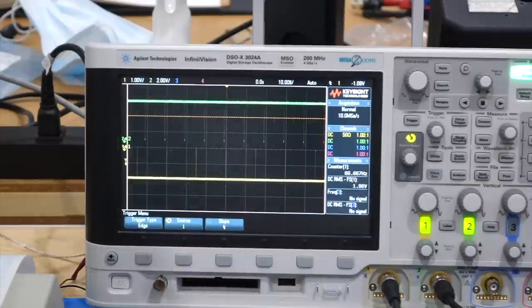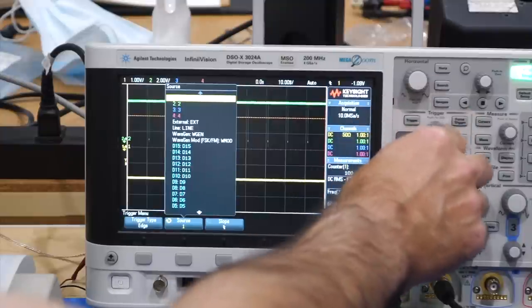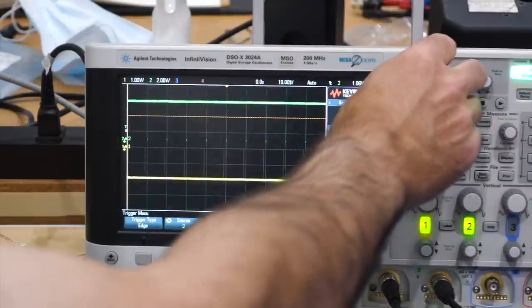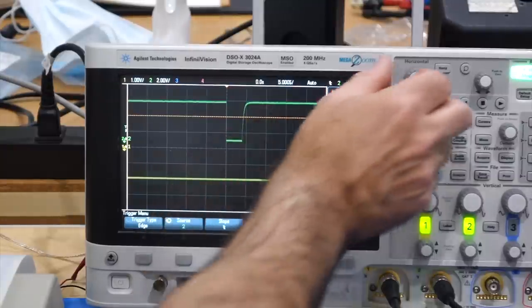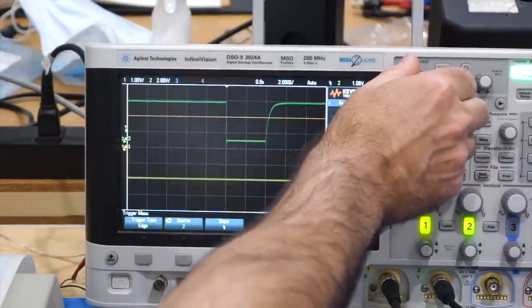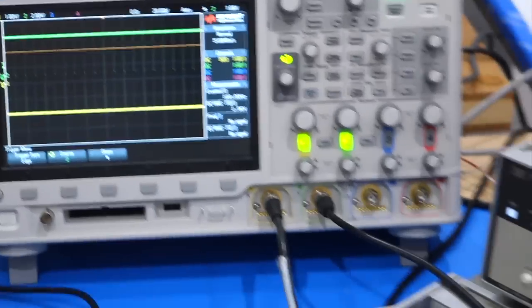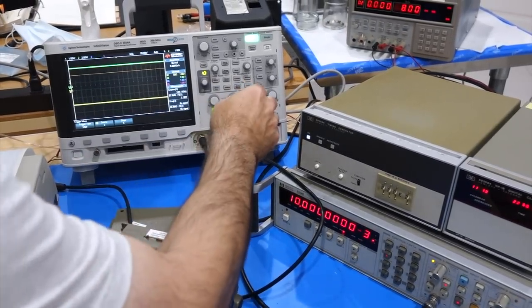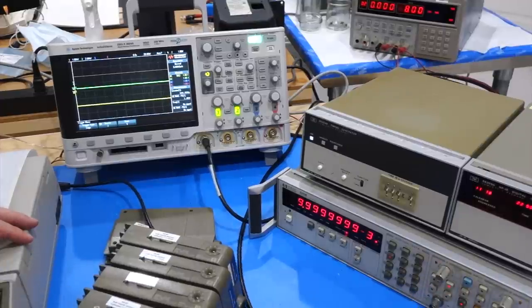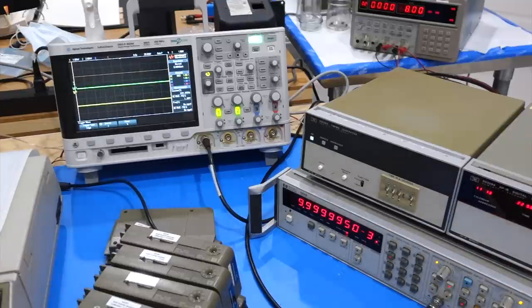I still have the boxed version. Now they're both at 10 milliseconds. Triggering on the other one — there you go. It's the same idea as the box it replaces: gives you a sharp pulse, about exactly four microseconds long. Let's see how precise that is — I calibrated it recently, calibrated all the interfaces actually. And we have 99999.50, so not too bad.